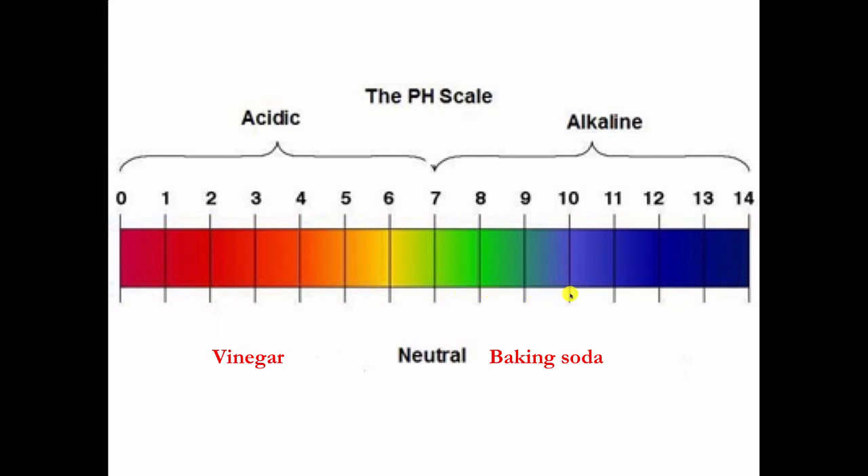If you use too much baking soda, you might get up to a pH of 10, which is okay — no corrosion there. But a little more baking soda and you get to pH 11, and at 11 you'll start to see foaming. Surging is caused typically by oil or dirt in the water; foaming is caused by the pH being wrong. Foaming is water bubbles that don't break — you get this surface that forms really tough bubbles, and it's very difficult to push steam through that bubble brigade at the top.